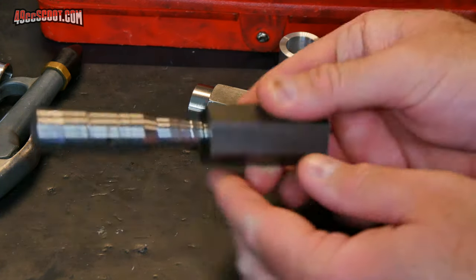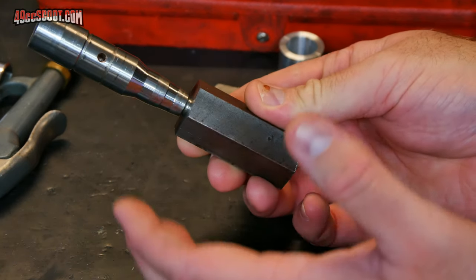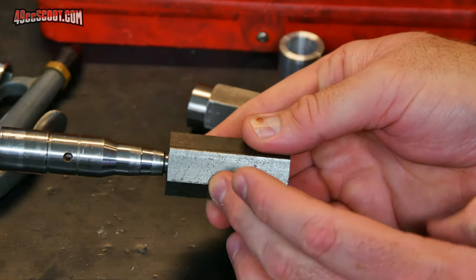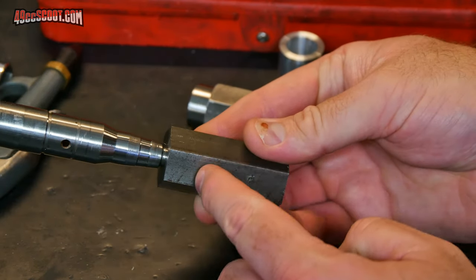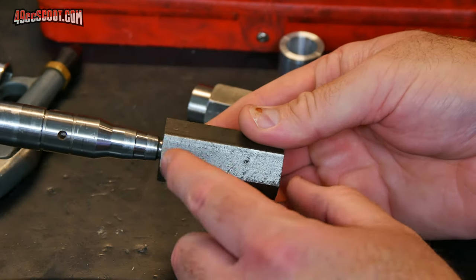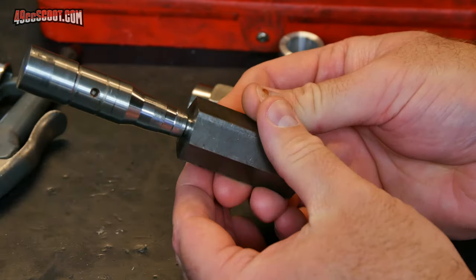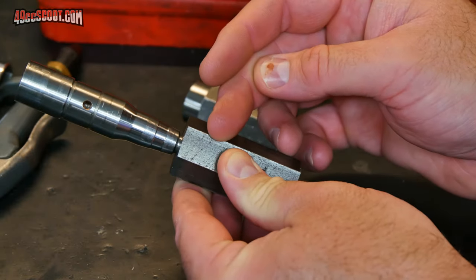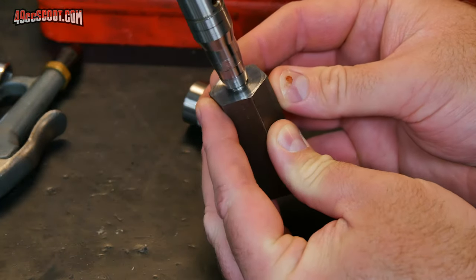Or to go with machining the threads into the piece first, get them as straight as I can still, and after that's done, just like I talked about earlier, then go ahead and machine down the rest of the piece. So with this example, the hex section would still be 14 thousandths of an inch out of round, but everything else would be true. So I could look into different options for maybe not using hex stock and just cutting flats into here so I could keep the entire piece true. But that's basically going to be the options if I want to work with that.